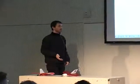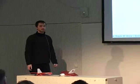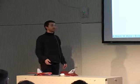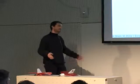Just for the modem, there is no perfect modem. You will choose this peripheral according to your mission. If you want to fly far, then you will have a slightly bigger aircraft. You will be able to carry a slightly bigger modem that will need a little more power, but give you more range, and so on.